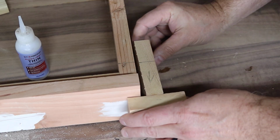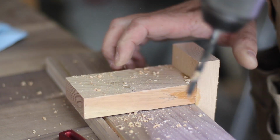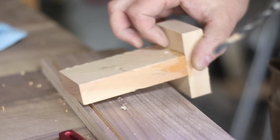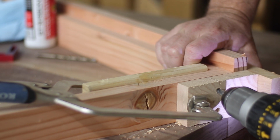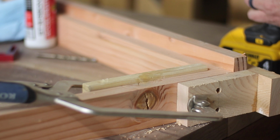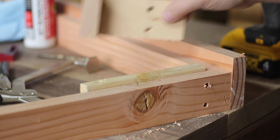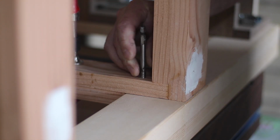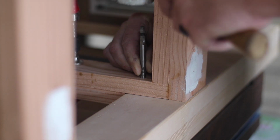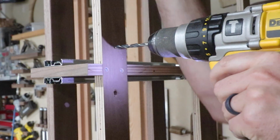After tearing the frame back apart, I built a little jig just so I could make registration holes of where I'd be adding the shelves to the legs. I was planning on using threaded inserts, so these had to be fairly precise. With all the holes drilled in the shelves, I was able to reassemble everything and just use a brad point bit to mark out where I'd be drilling to put the threaded inserts.